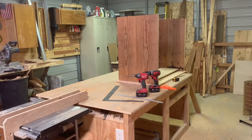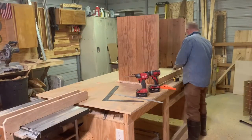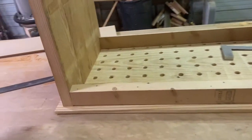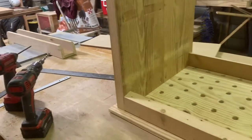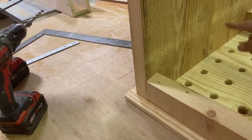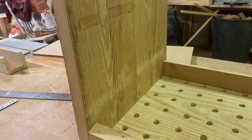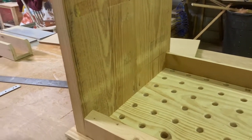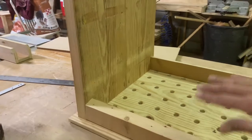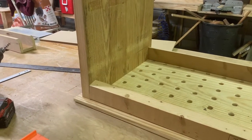Using that fancy new table saw fence, I just started cutting random angles until I found the one that worked. Turned out it was 14.753 degrees, but I just rounded up to 15. A little bit of figuring, a little bit of cutting and re-cutting. I put an angle on here so that I can create a trough, and I'll drill a hole in this end at the bottom of the trough that I can connect my vacuum to. I'm going to have a half-inch MDF panel in the bottom — just because that's what I have left over. I haven't spent any money on this project and I don't plan to.